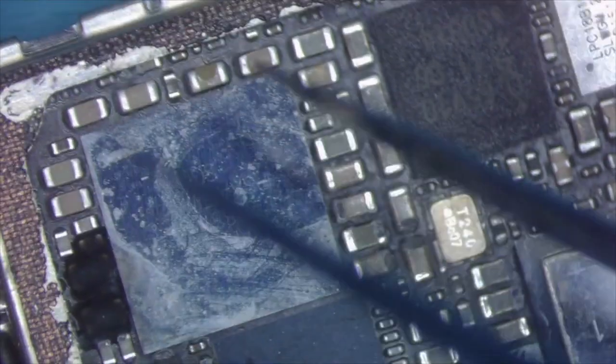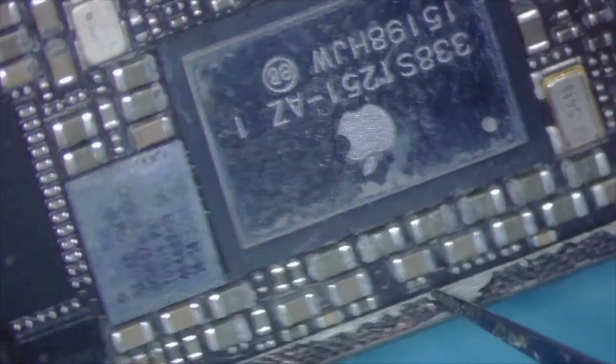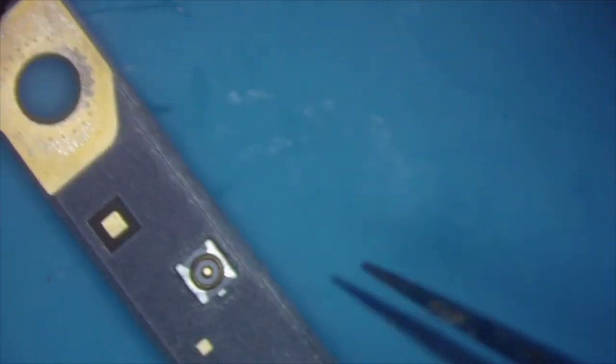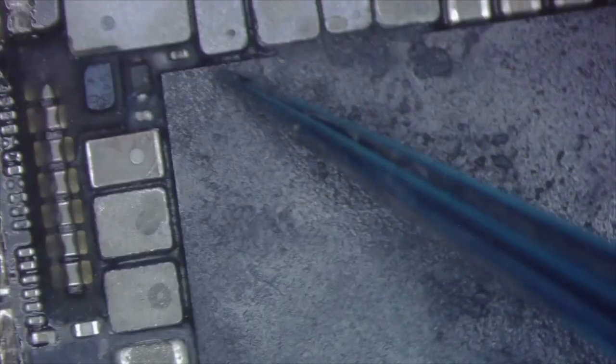So you see this one here, look at the one down there, that might be an issue over there. All of these capacitors, and again, we're going to really look for all kinds of signs because this is all evidence here and we don't want to wash it away. I'm trying to see under the plate, that resistor doesn't look good at all. That capacitor doesn't look good. Okay, and this wing of the phone looks alright. We're going to flip it and do the top side. And we already kind of saw this damage here. And ooh, that all next to the CPU does not look good either. And then under that shield, we're going to pray that there's nothing damaged.